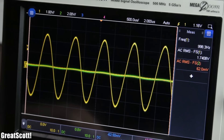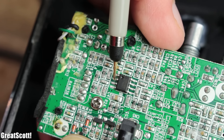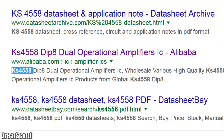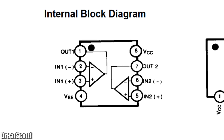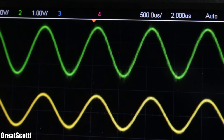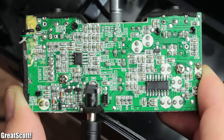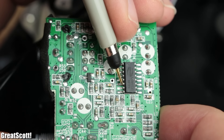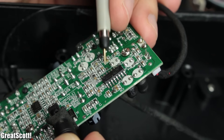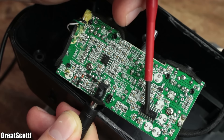Firstly, the audio signal's amplitude can be adjusted by the volume potentiometer, which acts like a voltage divider. Afterwards, the left audio signal connects to pin 2 of the KS4558 IC. And even though I did not find an official datasheet, the IC seems to be a dual op-amp IC, which most of the time features the same pinout. So I checked the output pin and recorded a non-inverted amplified sine wave with a DC offset. The bass control does slightly influence the gain of this op-amp configuration. This output voltage then feeds into the second IC of the amplifier board, the CS8563S, which appears to be a 2x 4.5 Watt Class D amp, which directly controls both of the speakers. In a nutshell, it is not that complicated, but the question still remains where the buzzing comes from.